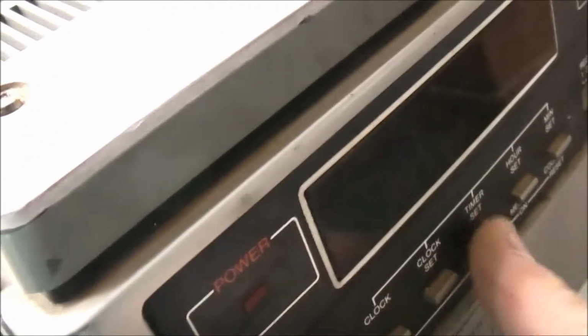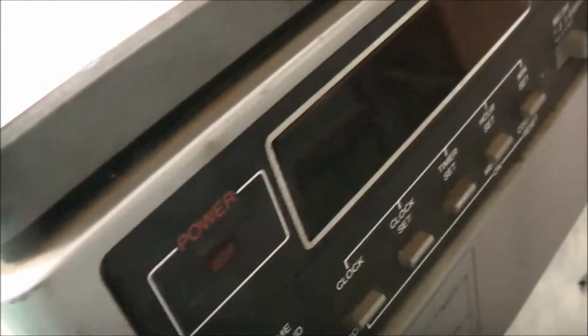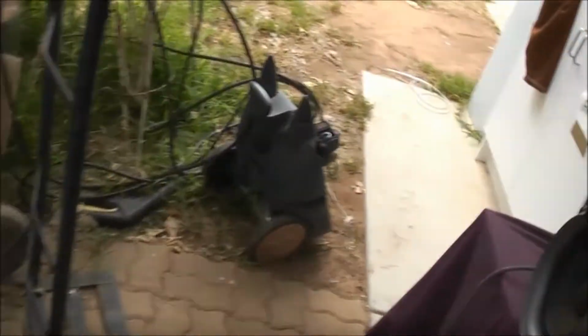Timer, standby. Where's that clock? It's supposed to be a little LED. Oh, I think it's a vacuum fluorescent display behind here. It's not lighting up. Let's try the bottom one, see if that clock lights up. Yeah, I'm not going to put a tape in these things till I get all the tape transport and the belts serviced, because you don't come across Beta tapes much, and whatever's on them, I want to preserve whatever's recorded on them, and rip it into the PC.